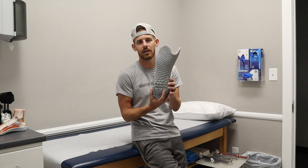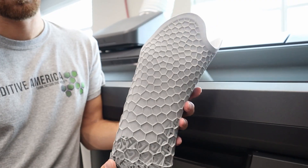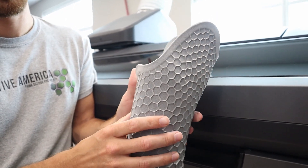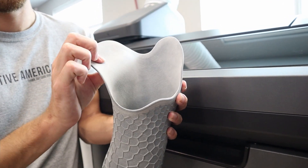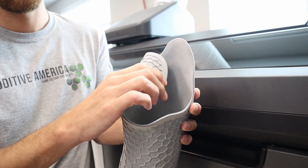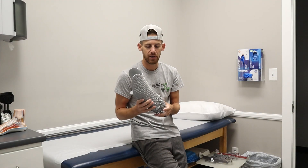What you'll see on this here — this is a liner, so it's going to go inside of a hard socket. The actual socket itself was produced out of the PA-12 material. This is a TPU material, so this is your nice flexible, easy-to-mold material. And then you've got your PA-12 bucket essentially that it all fits into — your PA-12 socket, your TPU inner liner.